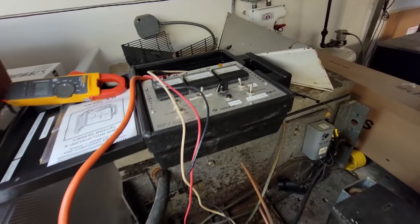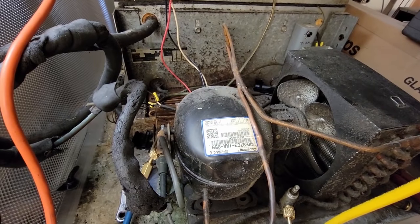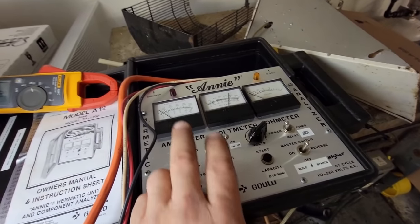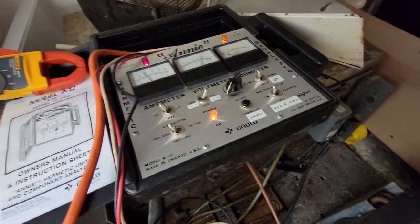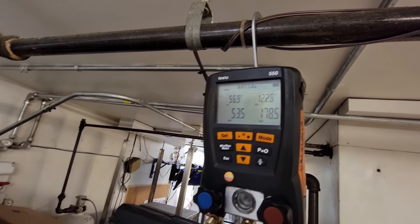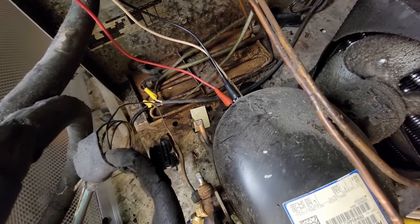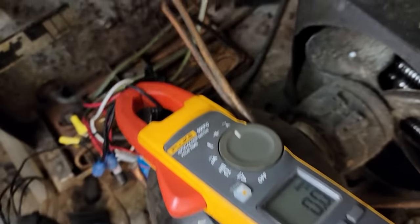We went on and grabbed the compressor's information - supposed to be like 7 ohms on one leg, it ends up coming at 10. The other one's supposed to be 1.2, it's like 2. But it's hotter than hell so the resistance is going to be higher. Verified which one was start and which one's run, got her hooked up. Going to see what we get here. We're going to go capacitor in, going to run. So it's running - it's pumping believe it or not. I think I had the capacitor on backwards.